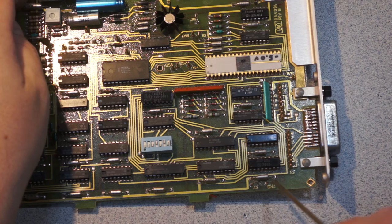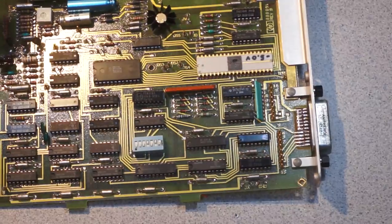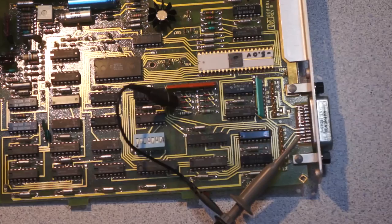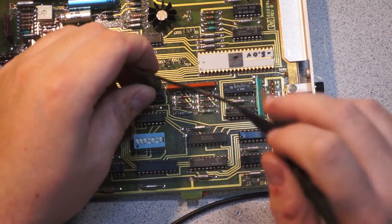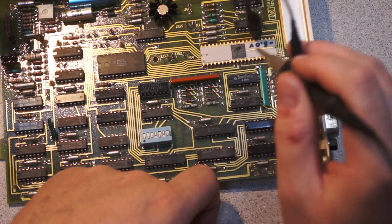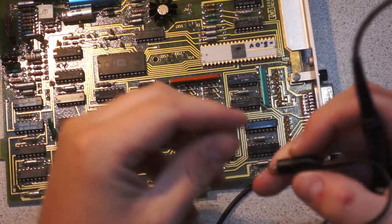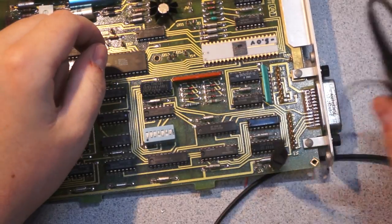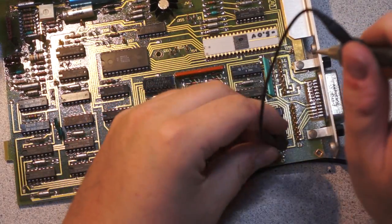It's intended so that when you have your scope probe and your ground clip, you're not trying to get onto this edge or that. If you're stuck probing onto the ends of leads, say you need a ground and you didn't have one of these nice test leads, you think, oh, look, the end of this diode is a ground, but then you're probing around, and suddenly you're dragging a presumably grounded pin all over the circuit board and blowing things up. Massive failure. Whereas with something big like this, it sits over it. You're probing around, you're tugging on it, and that isn't going anywhere. Well, I guess if you pull hard enough, but I was picking up the whole board.